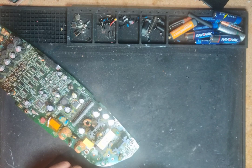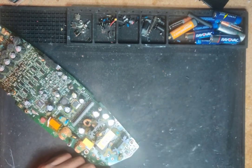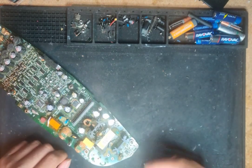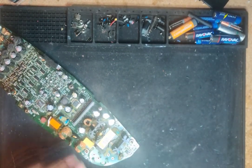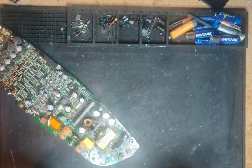I took that resistor off this board and put it on to the white unit — boom, life's good. It came on, my 12 volts was stable, 24 volts was stable, everything became stable because it was now generating its own power and self-regulating.